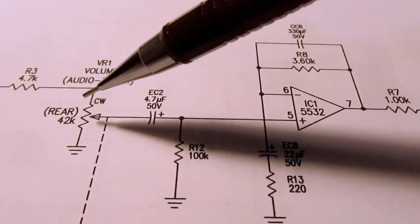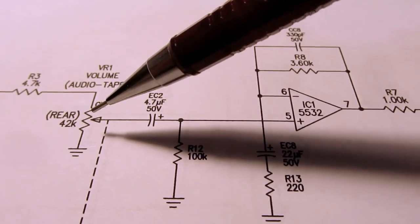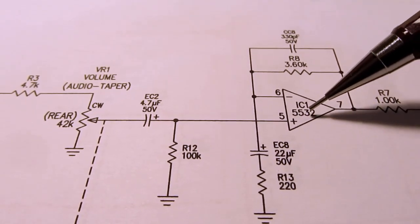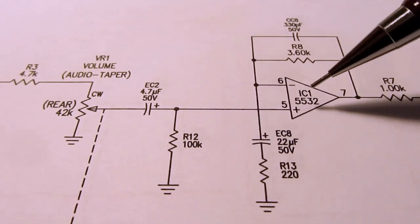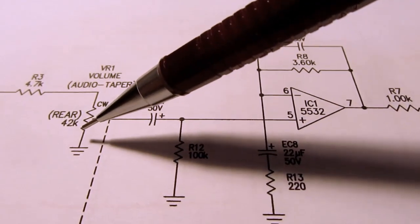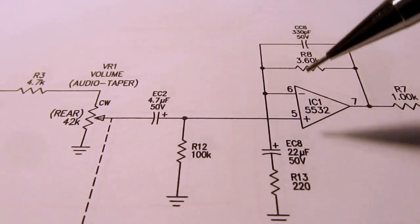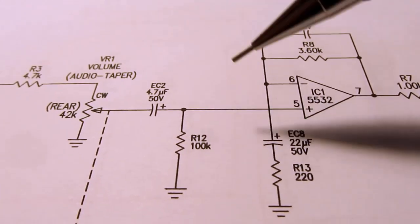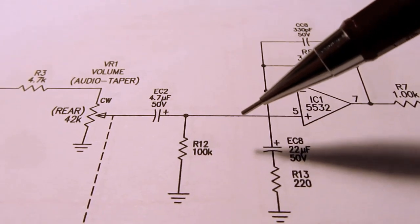and the attenuation you get here is such that it overwhelms the relatively low gain of this stage. So you don't always get a gross amplification. You attenuate it a lot and then amplify it back up, and depending where the pot is, this fixed gain might be more than the attenuation here, in which case you have a net gain or whatever.